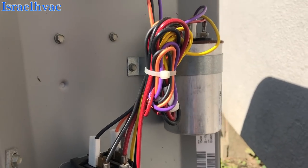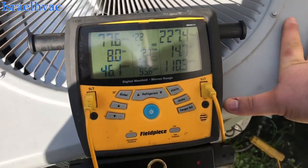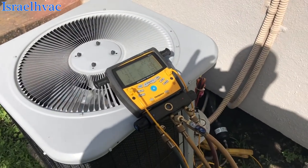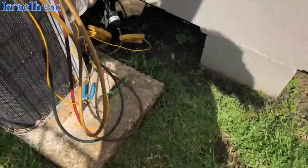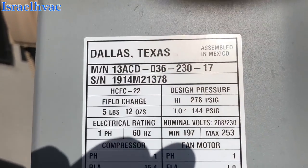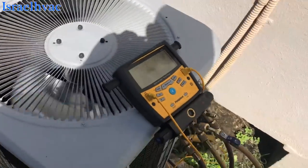I don't see why that breaker should have tripped. The refrigerant charge — working with an expansion valve, 14 degrees sub-cooling, plus or minus 3. I believe these are 10. I don't know if the sub-cooling is labeled on this one — no, it's not. But I usually go for 10 when it's not labeled. We're at 13. I'm okay with that.